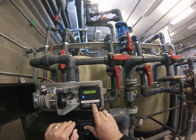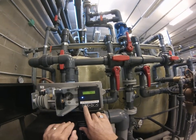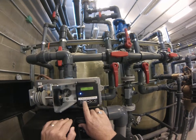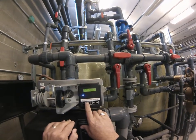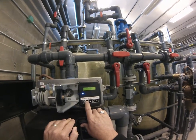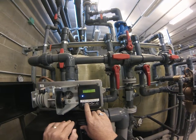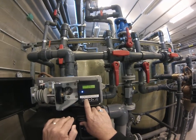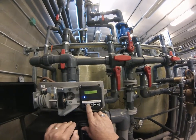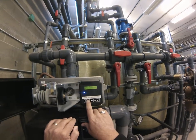English is what we want. So the next thing is to utilize the arrow key to go through each step. This particular unit is a system type seven alternating. The address valve happens to be one. There are two valves associated with this unit, meaning it's a dual alternating system. The water regeneration is immediate — when it goes to zero, it will immediately regenerate.